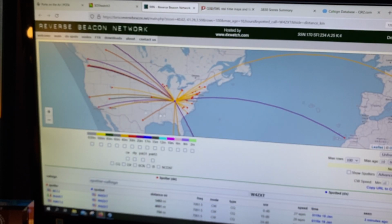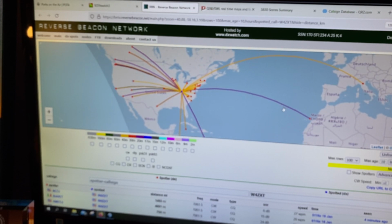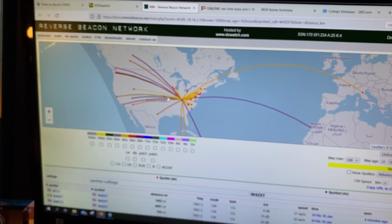Anyway, for this time of night, this is about what you would see for most antennas, dipole, or here in Kentucky anyway. One big hop across the pond. Interestingly enough, on 20 meters, the loop has like a 3-to-1 SWR. The end-fed half wave is perfectly resonant. I did the same test on 20 meters using the tuner in the radio, and the loop and the end-fed half wave were identical for the most part.